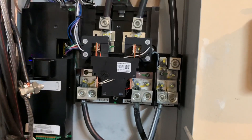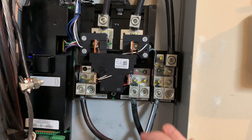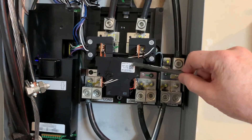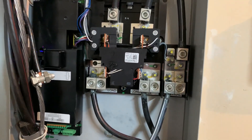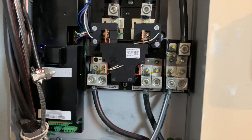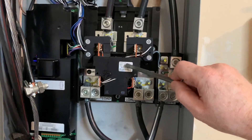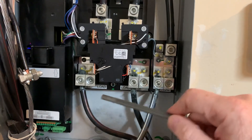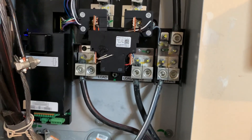What happens in a power outage? You'll have your solar hooked up to your home side of the electrical network, so your solar can feed into those lugs and power your home. When the grid goes down, the contactors will open so that no power from your home flows out through the electrical meter to the power company — because if somebody is working to fix the power outage and you're feeding power onto their grid, you could electrocute that worker. The contactors opening protects the lineworker and lets your house continue to have power supplied by the Powerwall. If you have solar, it will feed into your home's electrical system, recharging your Powerwall during the day and discharging at night.